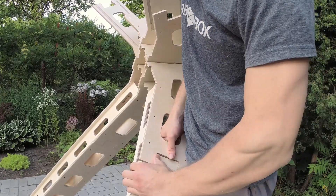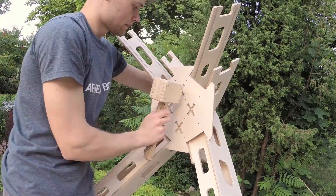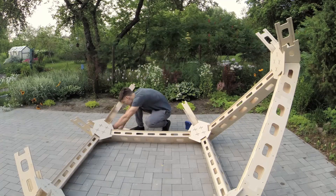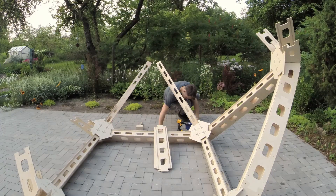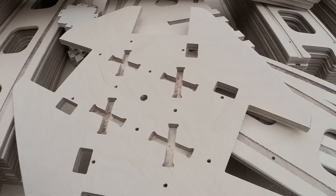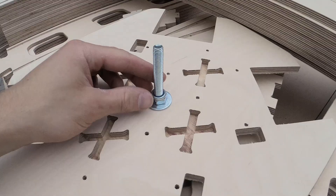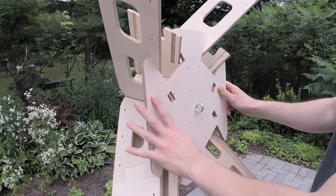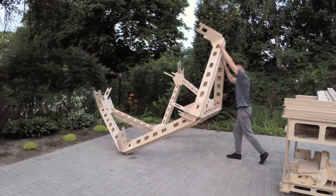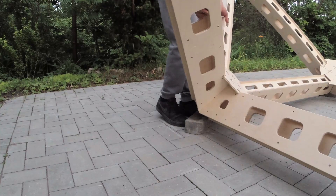The dovetail joint required some force to attach. To secure the corner parts I added a couple of screws. Before the first triangle could be considered done I had to attach the frame reinforcement component and the side part, then secure them with screws, and attach the corner reinforcement plate as well. Now I knew I could assemble the triangles — it was just a matter of erecting all four of them. I was slowly running out of daylight but managed to assemble one more triangle and test how well the frame held together when rolling it on one of the triangles. Since the forecast showed possible rain, I lifted the frame onto a couple of tiles and covered it with plastic film — if the frame got wet the wood would expand and the components would be more challenging to assemble.